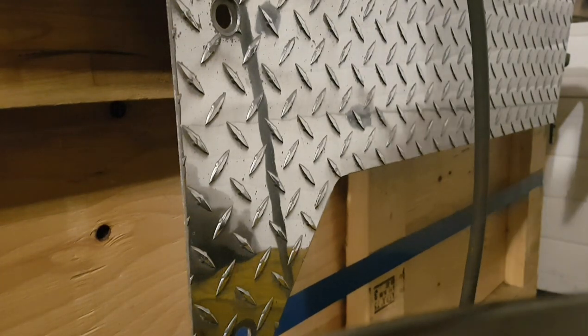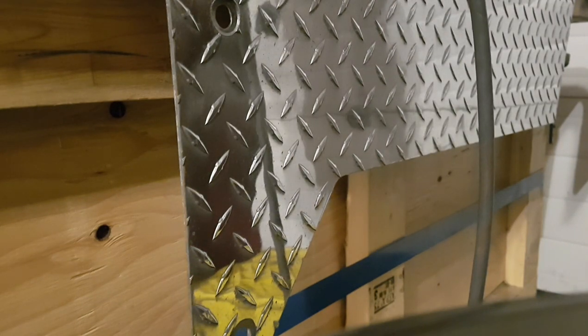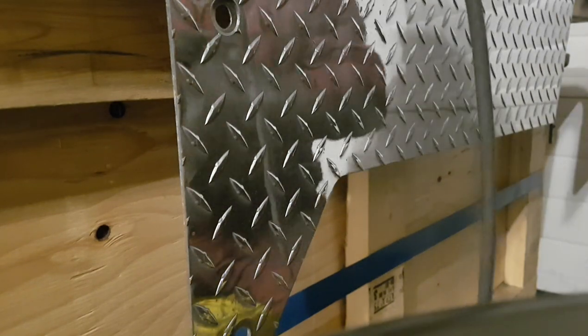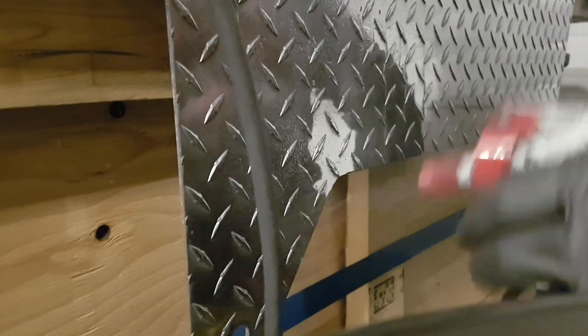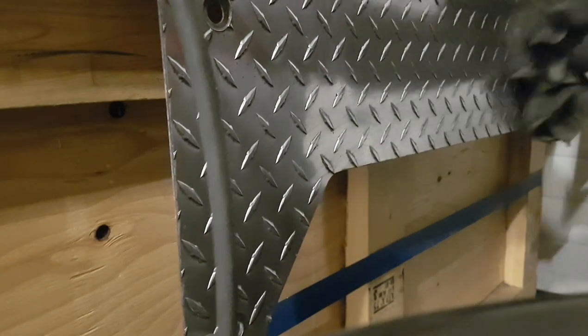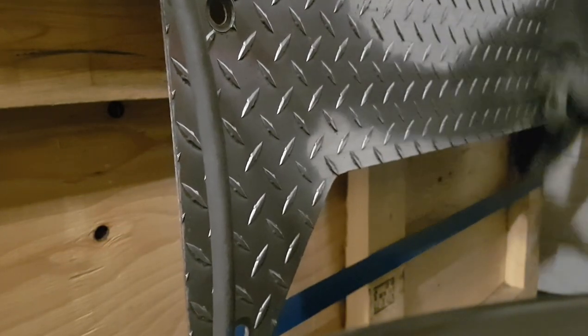Okay, guys, so I went ahead and yellow padded that. Now we're down to the finishing step, which is real quick. So I'll show you. Now, again, we want to spray it with our thinner. Give it a quick wipe. It's the same principle. What this does is we're going up to another step, so we want to try to get as much of our yellow polish off of the surface as we can.